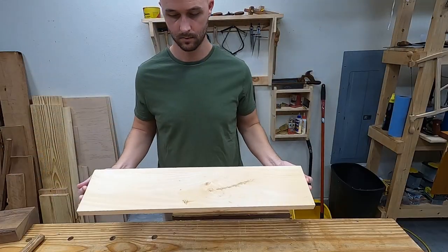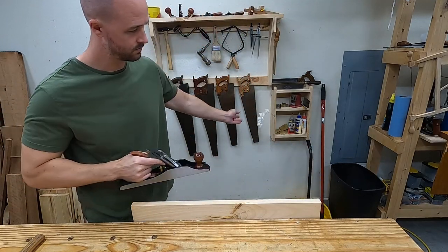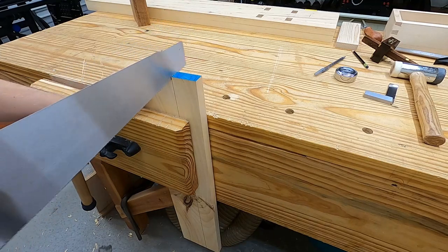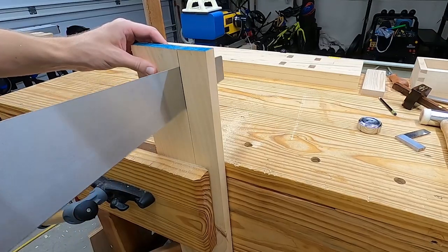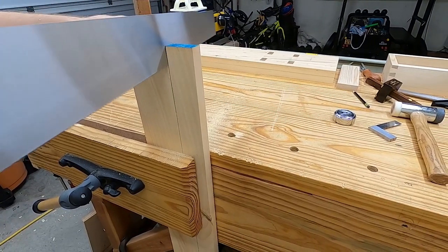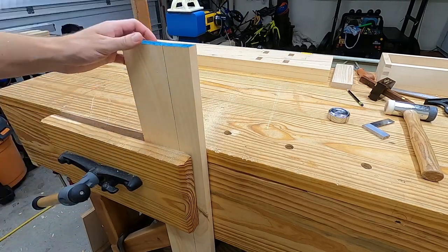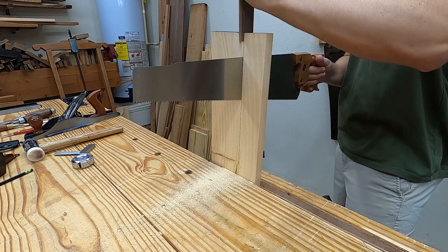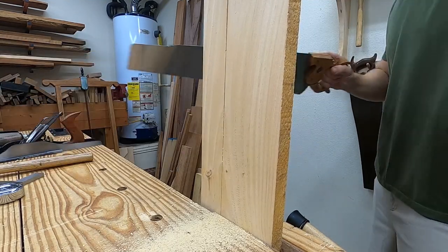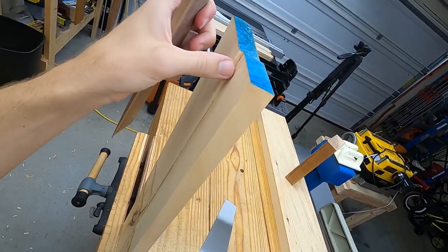This board looks like it should go right in the trash. With that massive knot and the crazy grain I know ahead of time it's going to give me some issues. But we're not made of money over here, so I'm going to use this for the cross braces on the saw till and I'll show you the issues that come up any time you use wild wood and how to rectify them. The saw is binding in the kerf and I'm not far enough down yet to fit a wedge, so I just re-saw down the kerf. Once I'm down further I stick a wedge in to open it up. Not only is this board binding in the kerf but it's also warping the other direction, so we're going to have both crook and bow to deal with.